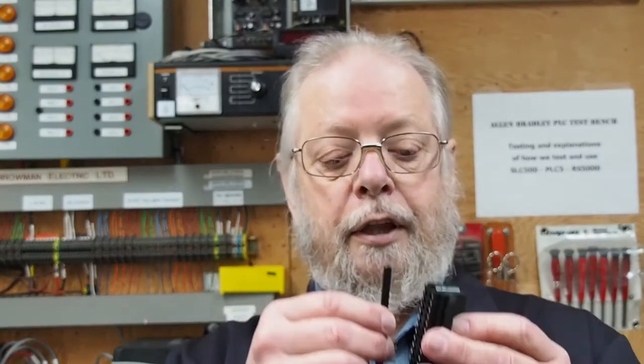The nice thing about this one is it is thinner on each of the tongs that go into the terminals. It has an integrated insulation strip, so if you're running 110 volts into this card — OW or whatever — you have a little bit of safety. Now, this is not a 100% perfect fit because it wasn't designed for these Buchanan-style terminals, but they do fit in there. It's a little tight by the time you get it in, but that gives you room to insert an 18-gauge wire in alongside the jumper, so rather than all your current going through one jumper in the card, you now have multiple lines.